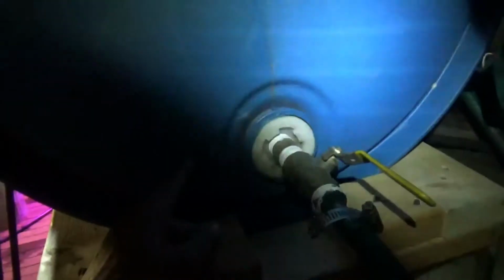So we're pumping out of this tank, out of the bottom, through the intake feed on the pump, through the coil, through the thermal mass to pick up heat, into the bottom of this tank, because I can't go on the top, because then we would overflow this whole big tank, and then out the top of this, and the overflow goes into this. We're supposed to go into some really cold weather here starting tonight, and then getting colder over the next few days, down into the upper teens.